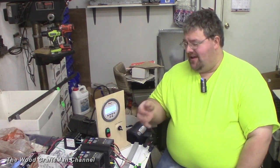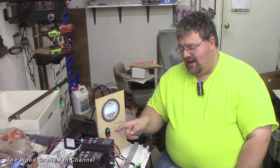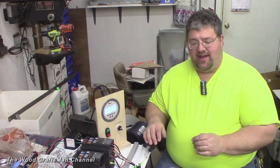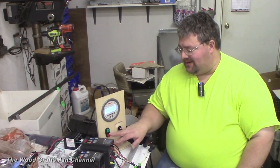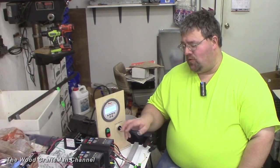If you're looking for an entry-level drive at a very reasonable price with a lot of features, check out the Automation Direct GS20 series. The nice thing is you can get a junction box to make it NEMA 4 so it doesn't have to go in an enclosure, but I'm using an enclosure to keep everything contained. Once fully operational, I'll mount this panel inside a cabinet that's 20 inches wide, 24 inches high, and 10 inches deep, with a hinged door. I've got the Digihelic mounted, the start-stop station, the auto-manual, plus a high-low switch for the spray booth and indicator lights.